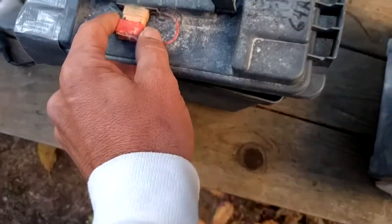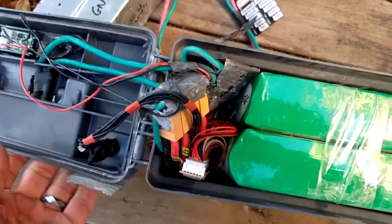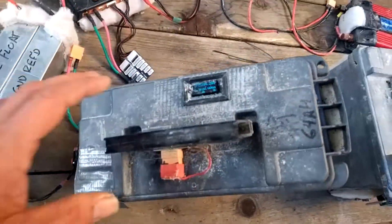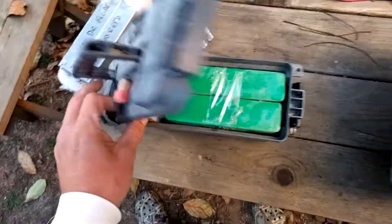As you can see it's about 16.2 volts, freshly charged. The circuit breaker and the BMS both do overcurrent detection, so it'll cut off at about 40–60 amps, which seems reasonable. You could technically pull hundreds of amps out of it with no problem, but I don't need that and it's scary.